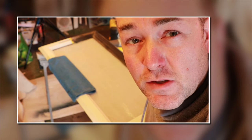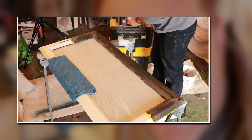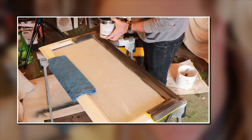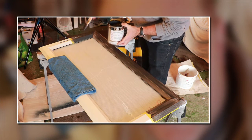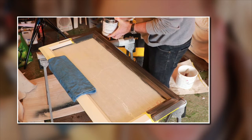It's a good 20-25 minutes since I put the first coat on. I'm now just going to do a quick second coat. Again, we don't want to be over-brushing it but we don't want to be putting too much on - get a nice even medium style coat going onto it. I'm not de-nibbing or anything like that, just coating up over the surface as it is. We've done the prep, we've done the first coat, now we're on the second. Still feels a bit glazy applying it.